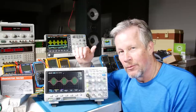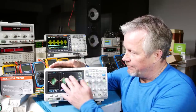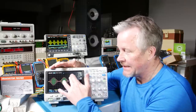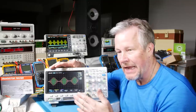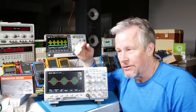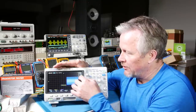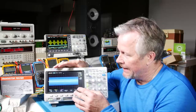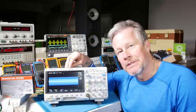What they eventually found out how to do with some nice analog scopes was a persistence feature — they could make the image stay there and then slowly fade away. A great thing about an analog scope is it doesn't miss anything, ideally. Signal comes in analog, goes to the screen analog — it's just written across the screen with no digitizing, no bits. You might be zoomed out looking at a whole bunch of waveforms trying to detect an anomaly, and you might see it glitch every so often. That persistence helped capture that.